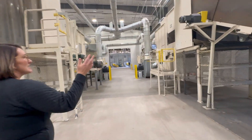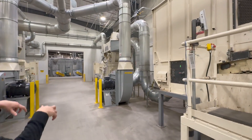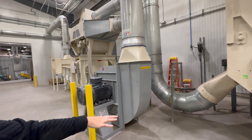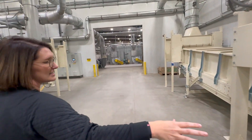So we'll go up this conveyor, through this hay buster. We've got a cylinder with hammers in here. They're chipping away at it, taking chunks of straw. It's going to be pneumatically conveyed through this elbow over to this condenser, where the material drops out and hits this conveyor.